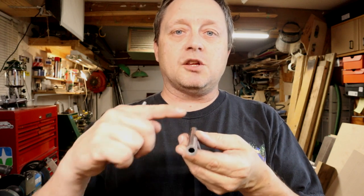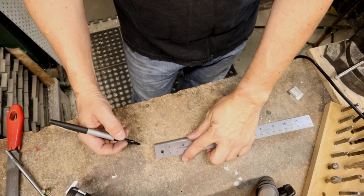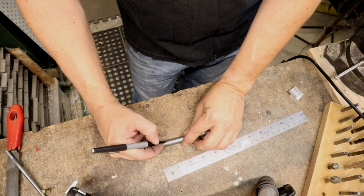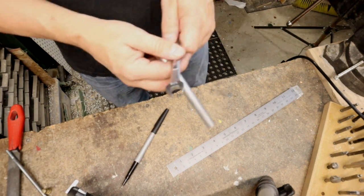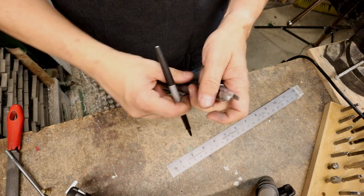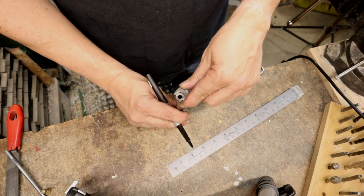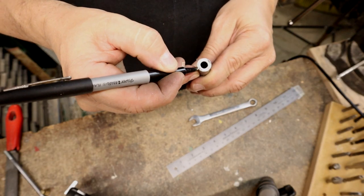So now we're going to make the wrench flat. I like to use a 7/16 wrench — this is a perfect size. We'll mark it, make sure that the wrench flats are perfectly parallel with each other, and we'll take a file and file down both sides, constantly checking with the wrench to make sure we don't go too far. One inch should do it, so we'll mark one inch all the way around. We'll just put the wrench down and eyeball it to get a rough idea of how far we have to go.